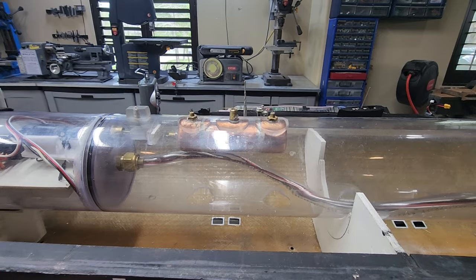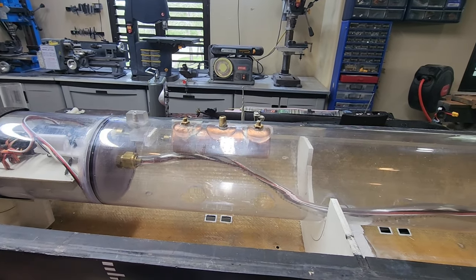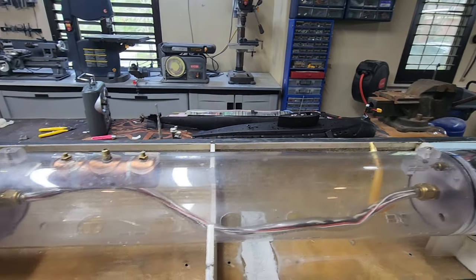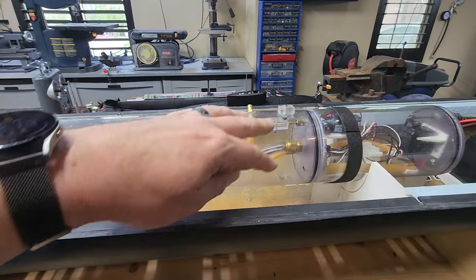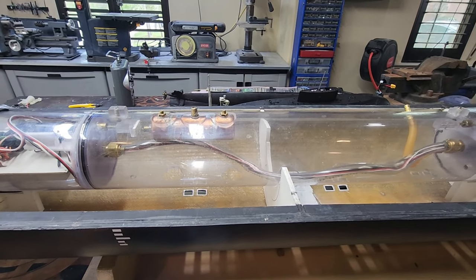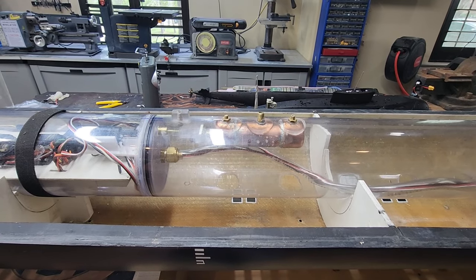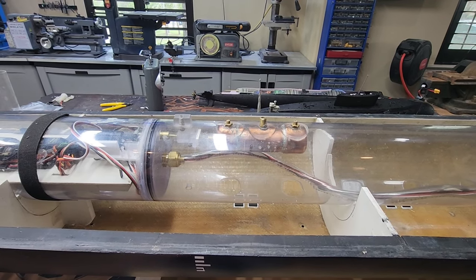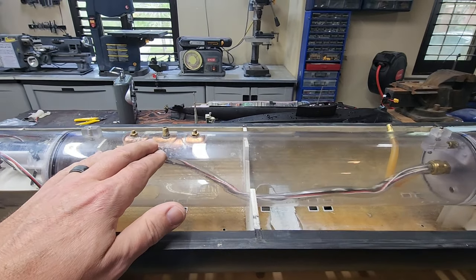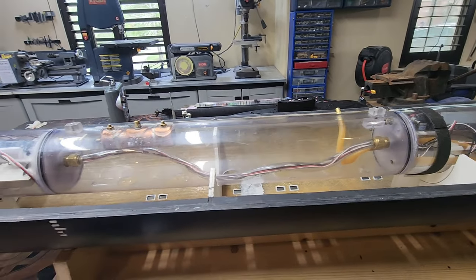If I go forward a little bit, this is neutral, and then if I go forward a bit, the air pump kicks on. So that's sucking air from the surface and blowing it. That's the low pressure system. Now if I really want to get up, I can hit the gas like this. So that's the emergency gas backup, so if you're fully submerged, you'll always be able to surface.